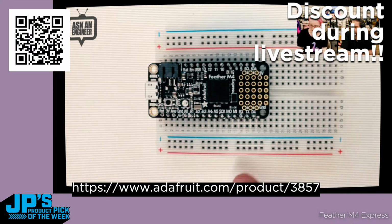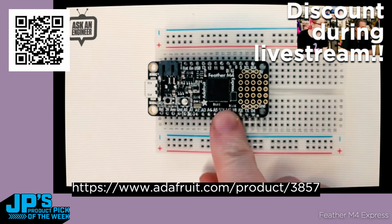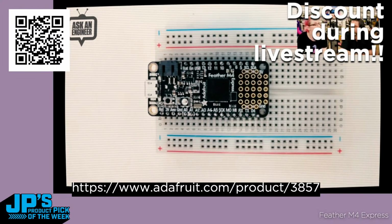We've tested it. Dual 1 megasample per second DAC, dual 1 megasample per second ADC, parallel capture, so you can do camera input. We've got some code. Yeah, we did some tests. It's impressive. It's incredibly fast for CircuitPython. Of course, you can use it with Arduino. We have a working Arduino core. It works great. We've tested all of our Featherwings with it.